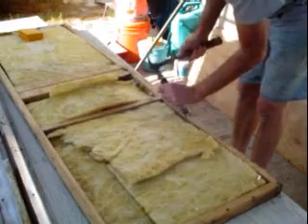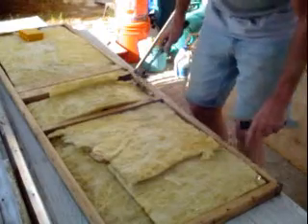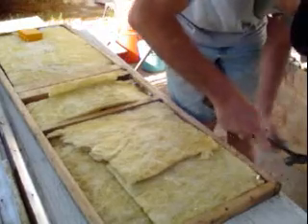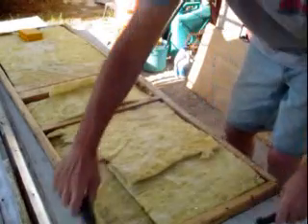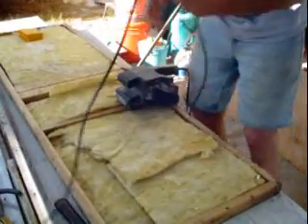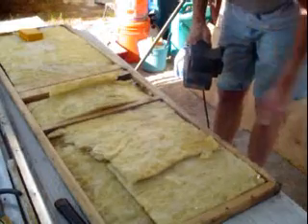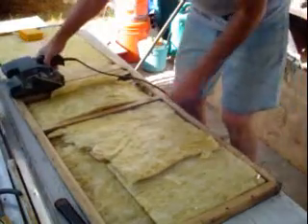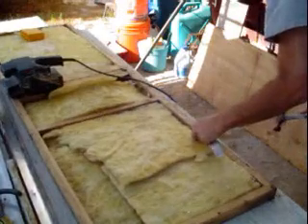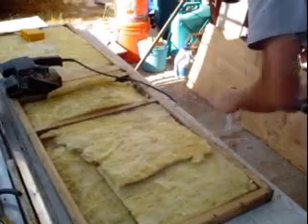This chisel is only about six bucks. And then I get it down to where it's pretty much gone — just like when I did the kitchen cabinets — and then just go ahead and take the belt sander to the rest of it. There's a lot of it chiseled away, and some of it just the glue is holding it down. When you get an edge you can do that. An electric planer could make this go a lot quicker — it's on the wish list for later on.